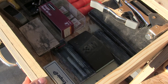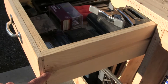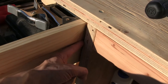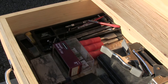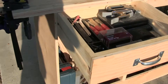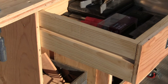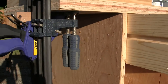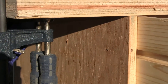What I did is I dadoed these — they're 1x6s in pine — and I put a dado cut in them. That dado cut actually sits on a piece of hard oak, sliding on oak runners. You have to be very careful when putting it together because if the oak runners aren't straight, the shelf isn't going to slide well. I used a conventional dado blade to cut those runners in, and I glued and also screwed the oak runners in.